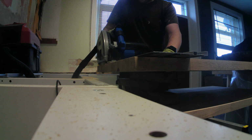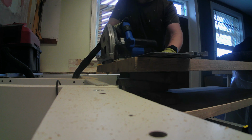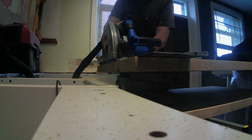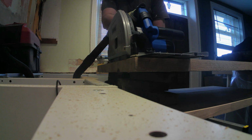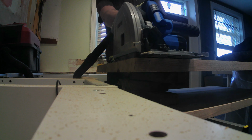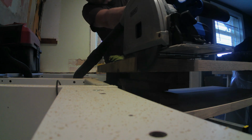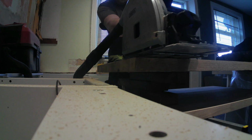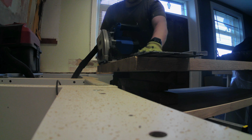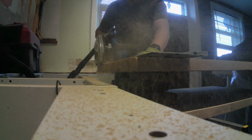and I'm going to make the cut now across the worktop, taking it steady. Got one hand on the track just to make sure it stays in position, and there you can see it does grip. I'm only using half the track for this, and there you see almost a perfect cut. I'm going to run it on again now.